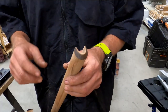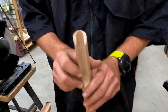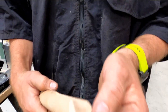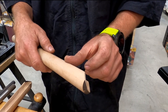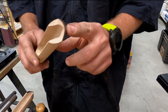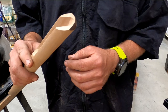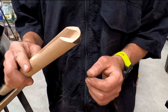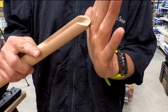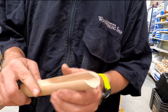The process of going from this to this will consist of first grinding those ears back. We'll take it straight up against the grinding wheel and go down until we get it to the very tip, then have it swept back as far as we want for our ears. After we do that, we'll set our grinder up to the right angle — which is typically between 40 and 45 degrees. There's a lot of debate on the correct angle, but just pick something and once you get used to it you'll be happy with it. Once you get that plate set where you can set this down and it makes contact with your wheel, then we're ready to remove the excess to get that Ellsworth grind.